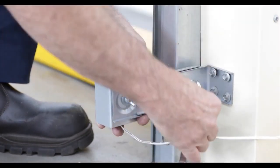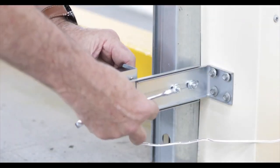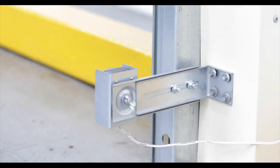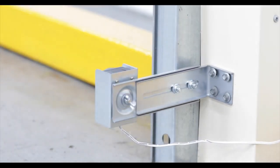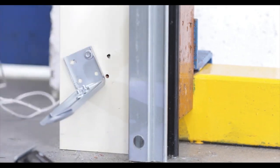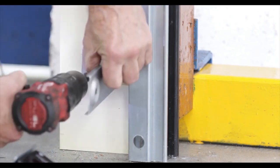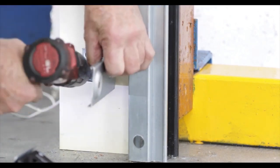Run the cable of the PE beams to opposing sides of the door. Best practice is to install these cables in protective conduit to avoid damage. These beams must be installed at a regulatory height as per the installation guide — place no higher than six inches and no lower than five inches above the floor level.